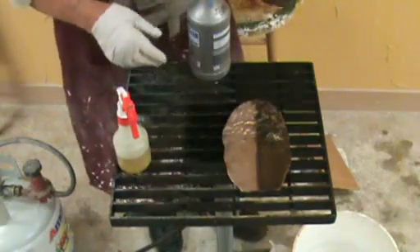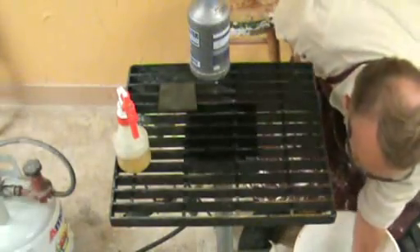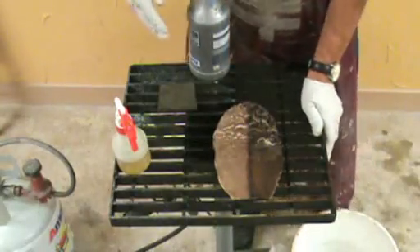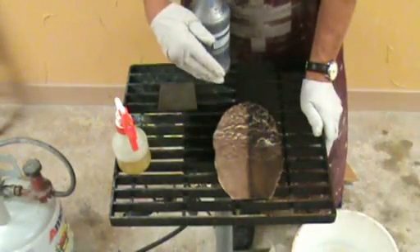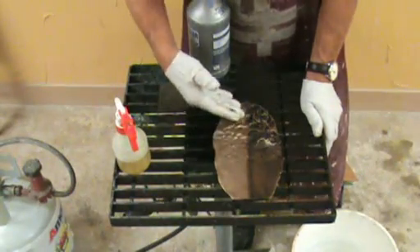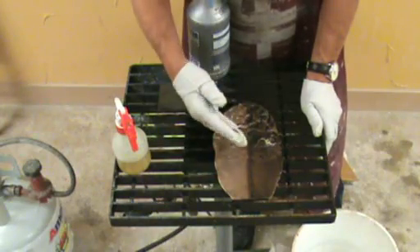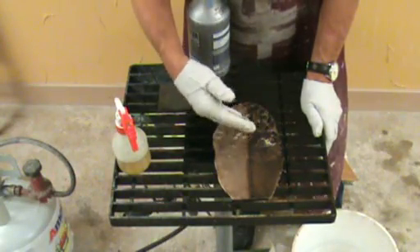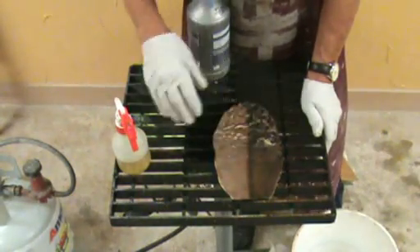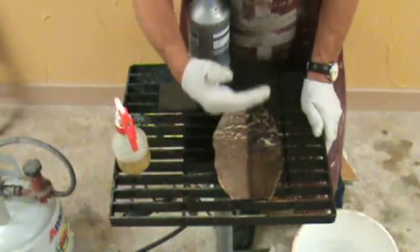As with liver and all other base patinas, we'll wash it off. Generally what I do is wash it and then take it up — meaning heat it with a torch. I put my base patina or undercoat on to how I think it should look, then wash it and heat it up. It usually turns a little darker, so I may want to burnish back again to expose more metal and less of the dark, because when you heat it, it goes darker.